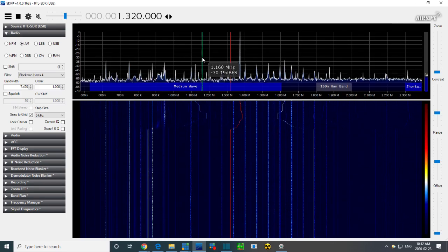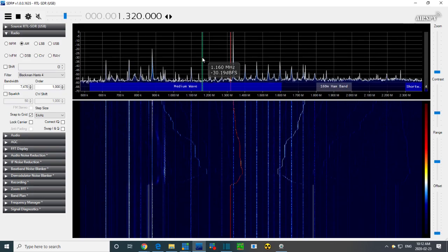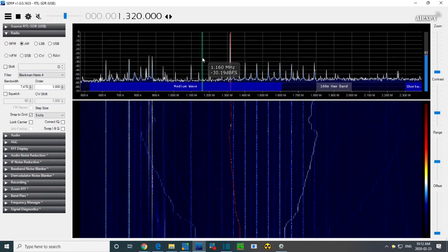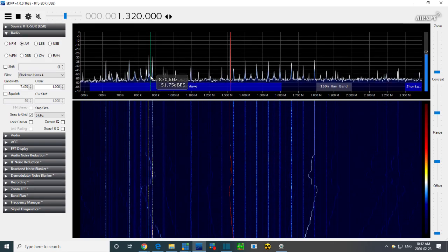Okay, I'm going to move it back. Right here. Now I see the bump as being right here. 870. The radio's tuned at 865. Now the tuning calculation I did involves 455 kilohertz. I don't know that the local oscillator, or the IF, is really tuned to 455. I don't even know if it's supposed to be 455. So we're going to find that out right now.